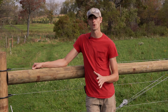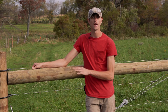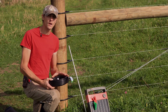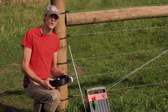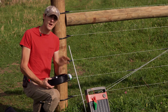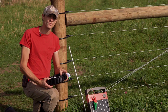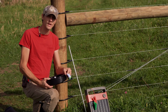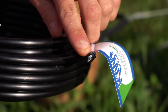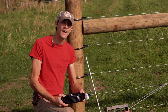The first thing we're going to do is combine all of our hotlines together using insulated coated wire as our jumpers. We'll be using insulated or underground wire to make our jumpers from one wire to the other. This is typically used to go under gate openings through conduit to travel electricity from one side of an opening to another — it's a great candidate for jumping your wires. It comes coated and insulated already, so we're going to strip away this coating to get down to the 12.5 gauge wire at the core, then use split bolts to connect that to our hot wires.